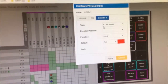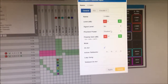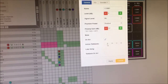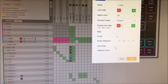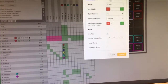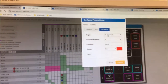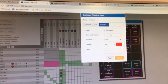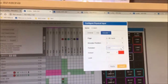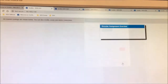For general settings, this is saying that it's a mic input, phantom power is there, and whether it affects the on-air button and active talkback associated with that — it's latching or ganging for the talkbacks, and whether it affects the on-air as well. Then for the encoders, you can choose the position of them on the grid, their function — whether it's level or metering only. For some of the other ones you've got pan on the same control, and then the colour of it. So it's all colour coded.